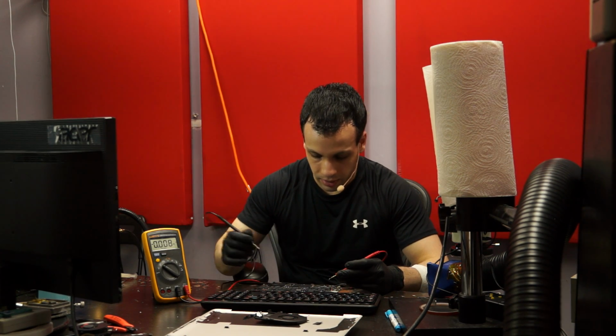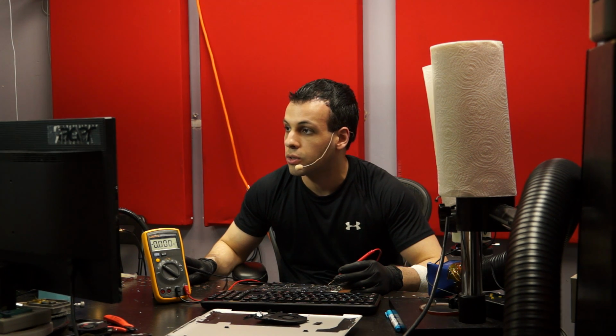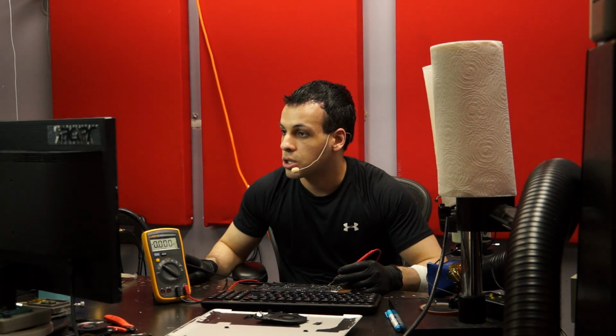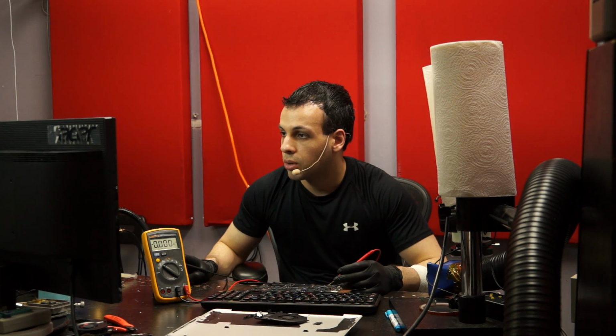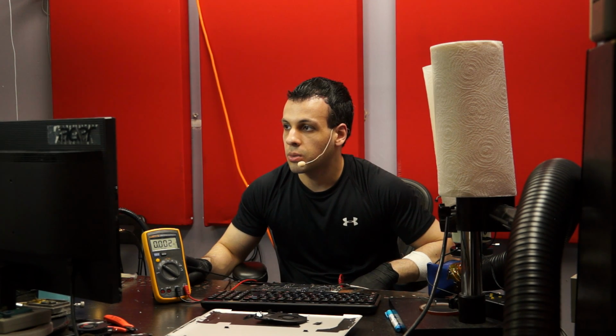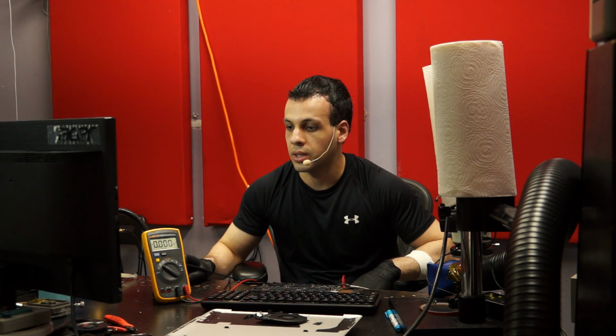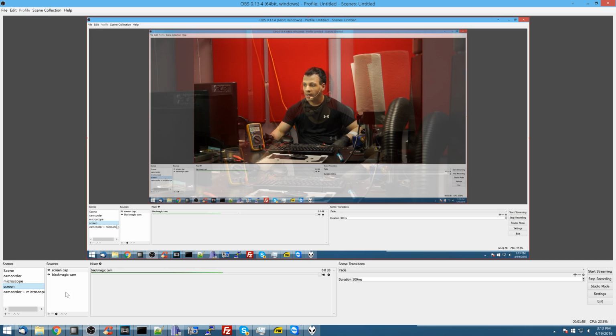PP3V42 is the rail that has to come up first. So how do I find PP3V42? You may be wondering if you're a new viewer to the channel. Well, let me show you over here with the board view software how I would find that. And if you don't know why I need that rail to come first, I would highly suggest you check out my older videos, like my one-wire circuit videos, where I go over this in great detail. But we're not going to do that right now.